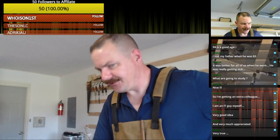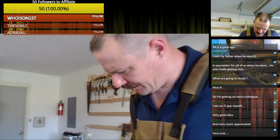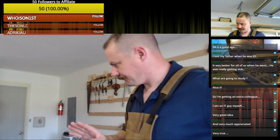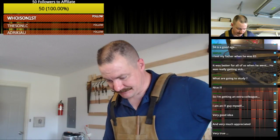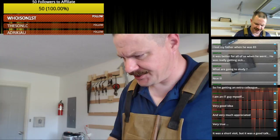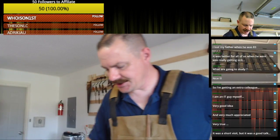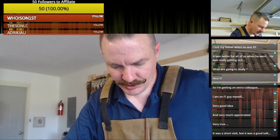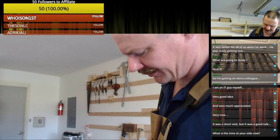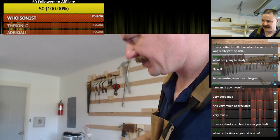And next time, so Friday, we're going to have to figure out what order we want to do these. I'm going to sand these down a little bit, get the glue off, plane it flush. We'll start thinking about how we want to do the miters on there, because I'm just not really sure at the moment. And we can kind of gauge, now that we have the thickness of these, where we want to do our splines, because we want the splines to be evenly spaced.